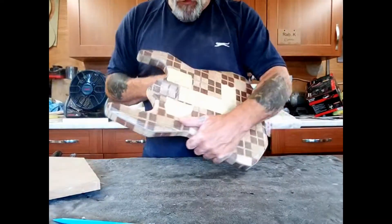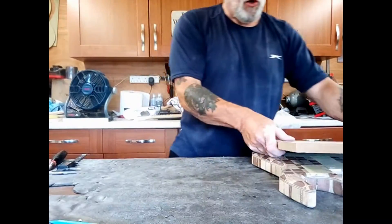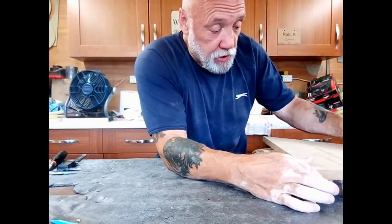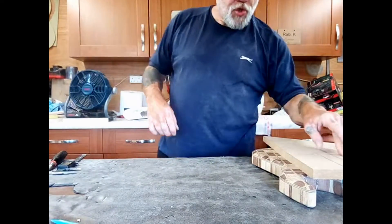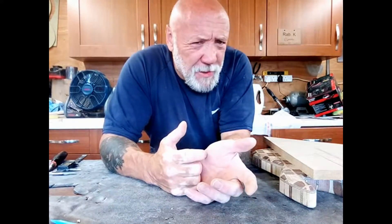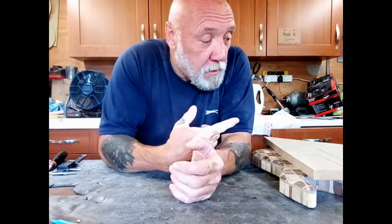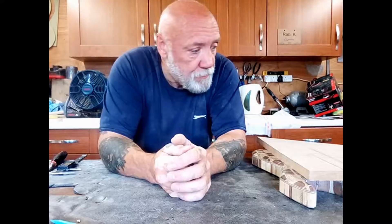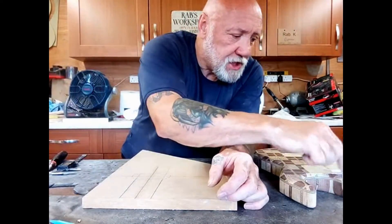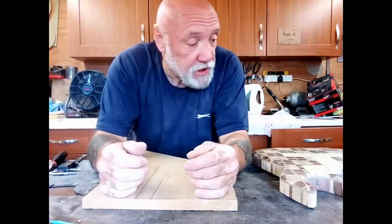What am I doing today? Well, right to it — I'm going to make a template that'll sit in there for the first humbucker, and it'll be thick enough when the neck's in. I'll consider this one and route out that part of the neck and the body at the same time. I'm going to make a template today, probably not much more because I want to get back to sanding. We'll get the router out, get it all taped in, get a bottom bearing bit, and route it out properly. That way it's just ready to go on the body. I'll get the forstner bit and take the rest of that away as per usual, then route the rest — then we've got a clean surface. That's the plan.